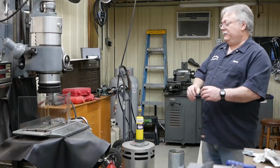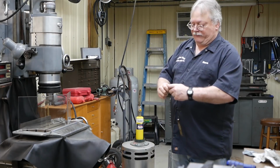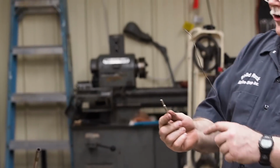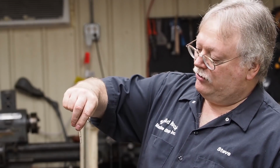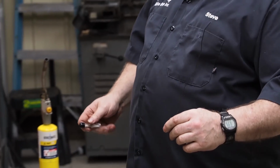And I thought I was going to have to either buy a collet or make a collet. I forgot that they actually make these CBN wheels where they're necked down. I'll have to relieve it a little bit more, but I'll just throw that right up in the mill over there, and I'll put a lathe tool in there. This is a soft steel. I can just use a regular insert, cut that back just nice as can be. I'll be able to use that wheel to go all the way through both sides of the part. This is a fine grit plated CBN wheel, and that's what we'll grind the quarter inch holes out with.